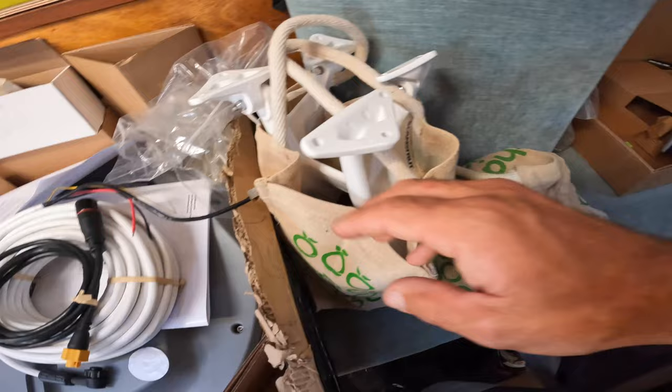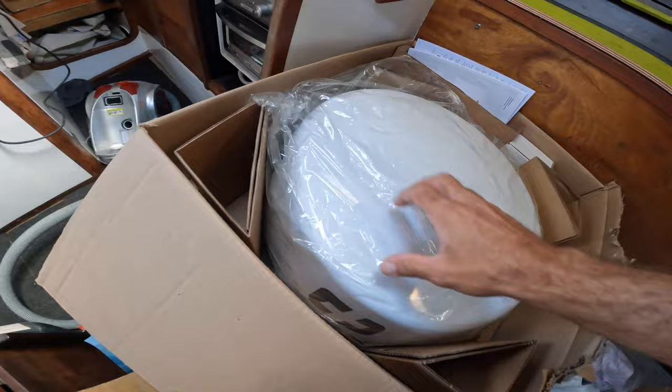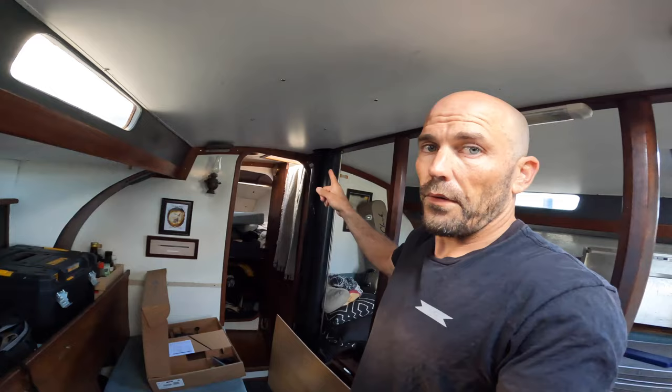It's time to go up the mast. I've got rivets, the rivet gun, my drill, drill bits, and a Scanstrut mast mount for the radar. The radar is a B&G Halo 20 Plus. I'm going to mount it just above the spreader on the port side. I'm putting on my climbing gear — I'm alone as always, but from an arborist background I've got all the gear to safely go up, attached two points at all times. This wind — you can go now, I don't need you.